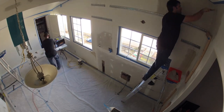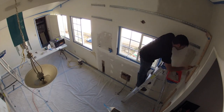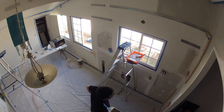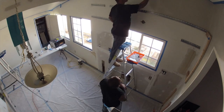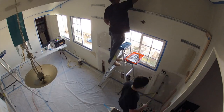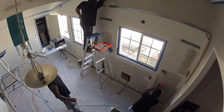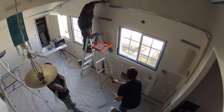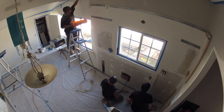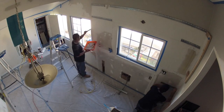Eddie was painting and I jumped in right after lunch — I just wanted to get this area finished with paint so I could work underneath it. We chose this color and we really liked how it looked when the kitchen was finished. Here you see me checking for studs on the wall where the base cabinets are going to go and drilling in a couple of anchors into the studs for the brackets.